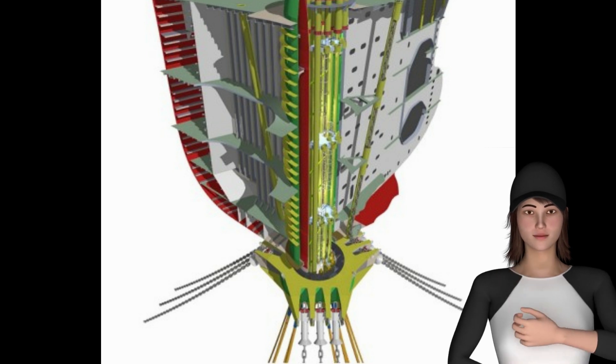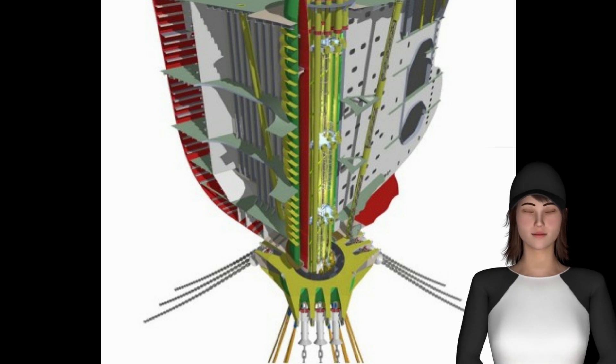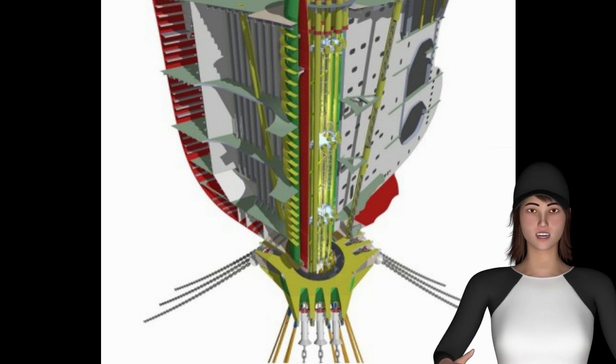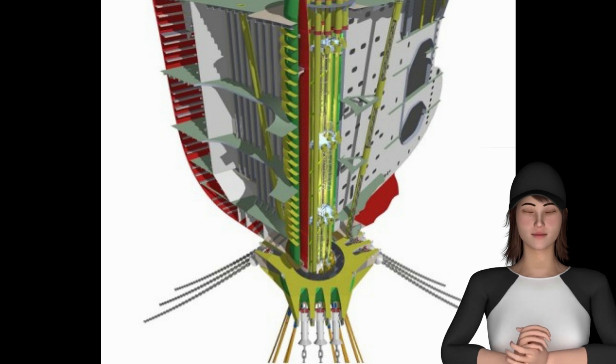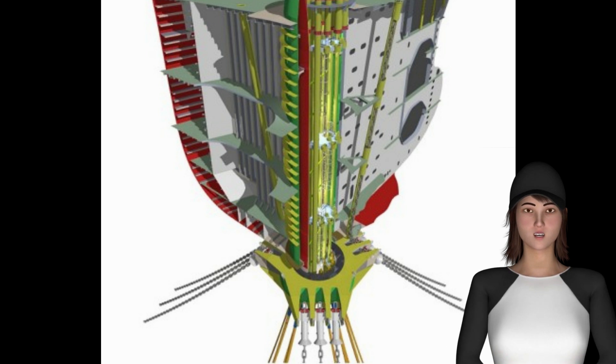The supports of the bearings are integrated into the turret casing, which is part of the modified vessel hull structure. Typically the turret casing is a cylindrical structure that is integrated between the bottom and the deck of the vessel and transfers the turret loads via the vessel or web frames to the vessel hull structures.